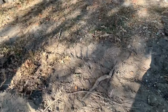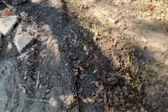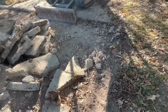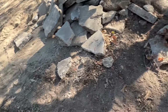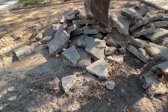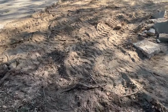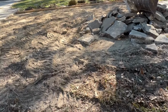You know, the original concrete was in a straight line and it was really high above the dirt, like 6 inches. It was an ankle breaker and it was hard for the lawnmower to jump up and down. So I'm gonna come from this concrete and slope it down maybe 4 or 5 feet. And the same on that end. And this whole side is gonna be maybe 2 inches lower than it used to be. And that'll be good because a lot of this concrete is like 6 inches thick, which means it wouldn't have enough fill in there if I just wanted to put the form back where it was without pouring 6 inch concrete, which I don't want to do. So if I lower this form a little bit, I think this fill quantity will work out just right.